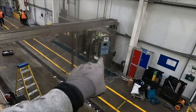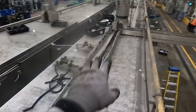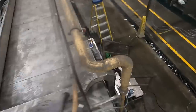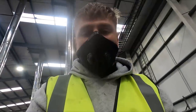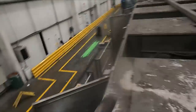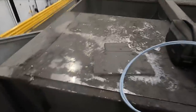So that's the BMS control panel there. Everything rises up in that trunking, comes along, and then we're on the top of the washing machine. So we've wired in two new door actuators, which are just laid on the floor there. One of them drops through this trunking, then into a bit of stainless, round, into a door actuator under there. They're basically a pressure switch. So if you open the door while the machine's running, it cuts off that area of the machine as a safety fail-safe. So two of them have failed. There's also another one just a little bit further along that we've rewired. Then at the end,